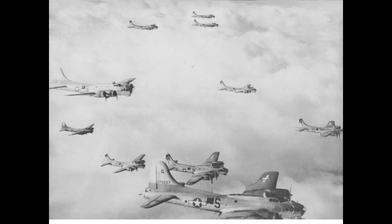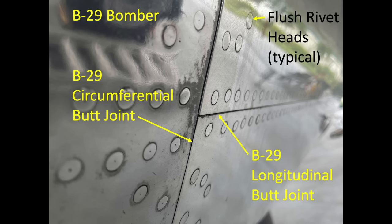Also, 80 gallons of fuel equates to 490 pounds of weight. An unpainted B-17 will require 490 pounds more fuel to meet the range requirements of a painted B-17. Therefore, the 75 pounds of paint weight more than offset the 490 pounds of extra fuel required for the unpainted B-17 to meet the painted B-17's performance goals. The extra engine power requirement for the unpainted airframe is not likely experienced with the B-29s, since B-29s are designed with aerodynamically clean wetted surfaces — the B-29's airframe skin panels are joined with flush fasteners and skin butt joints.